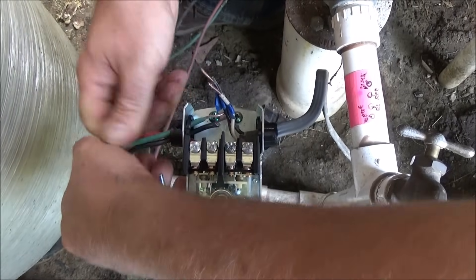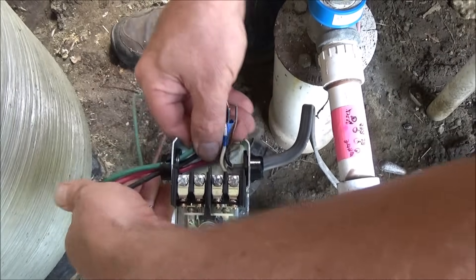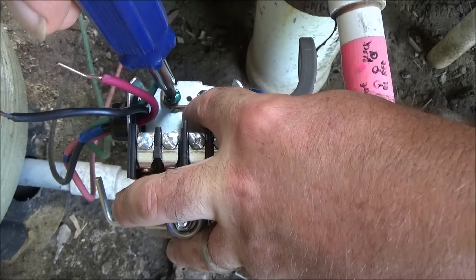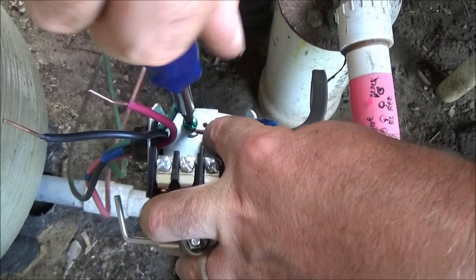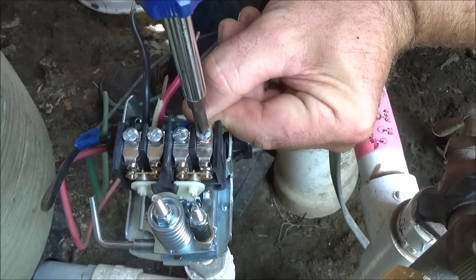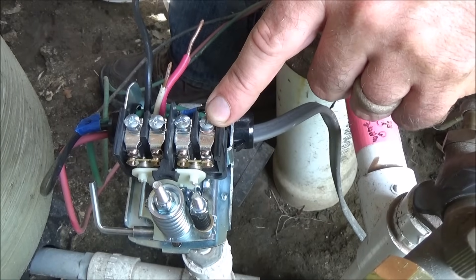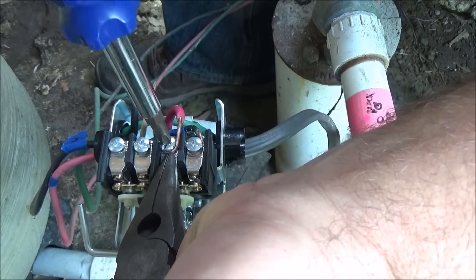Feed the wires in — it takes a little bit of force. You want to give yourself some slack, some extra length, so pull those through. I'm starting with the ground wires. Notice that I bent the wire going in the direction that the screw is going to turn so it will tighten rather than push the wire out. Connect your wiring the same way it was in the original, starting from the left and curving it around so that as you tighten it, it pulls into the connection. You might need needle nose pliers to push it right against the screw while tightening down.